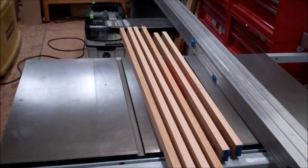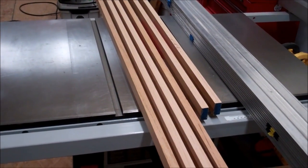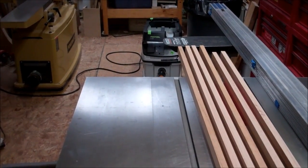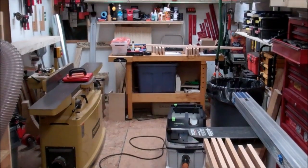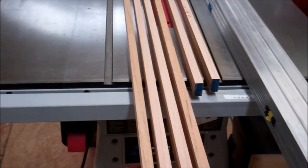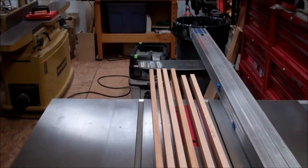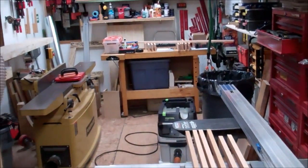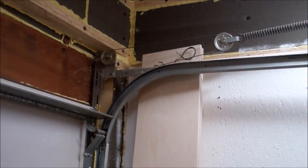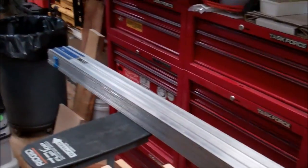It's all rough-sawn wood I bought before I had a joiner, planer, and everything. So it's some old, old oak. I took probably a 1×6×10 and milled it up to everything you can see on that far back bench, and a 1×4 and some other pieces. I'm assuming it'll be dimensionally stable, and it's not doing anything in my shop, so I might as well use it for the Pinewood Derby track. Right there is some half-inch Baltic birch plywood that will form the base of the track, and there are the actual aluminum tracks stacked on each other.